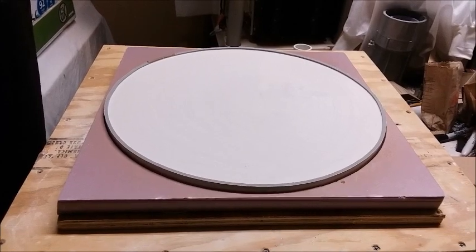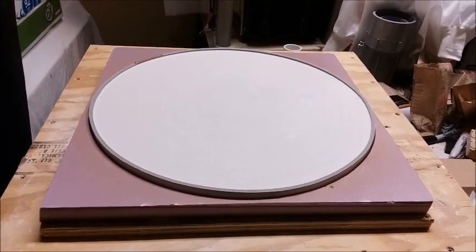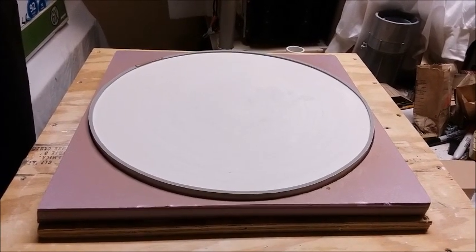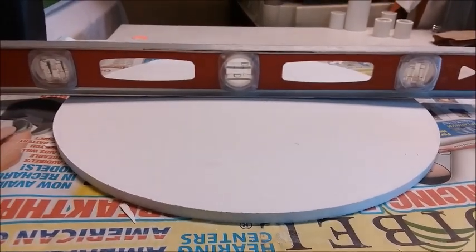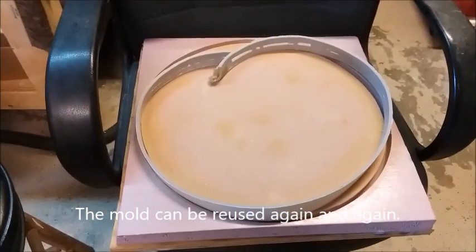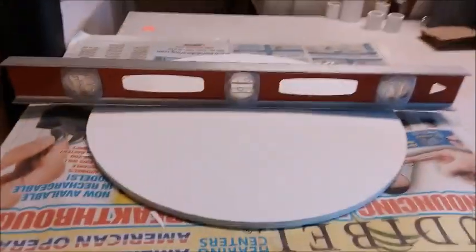This is about the same thickness I was doing with the 10 and 12-inch slumping molds — maybe a little bit thicker, but it's bigger, so it needs to support its own weight better. Here's the finished slumping mold out of its own mold. I said I'd pull it out the next morning, but in reality I left it in the mold for about three days. I've had problems with these molds warping while they're green and wet, so I let it get good and hard, develop some strength, and dry out a bit before removing it.